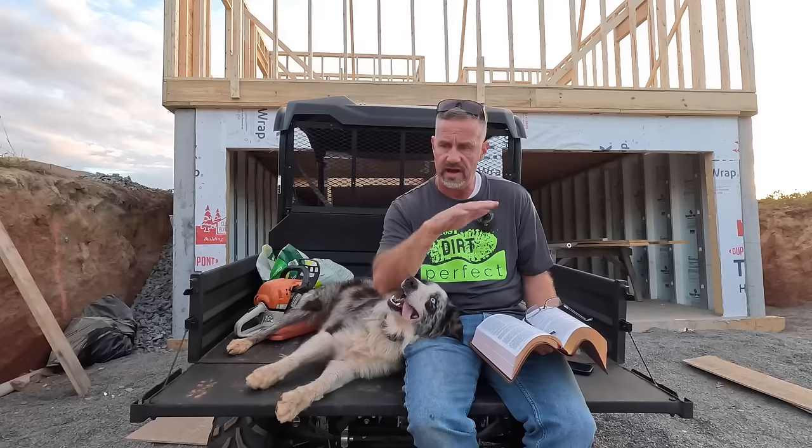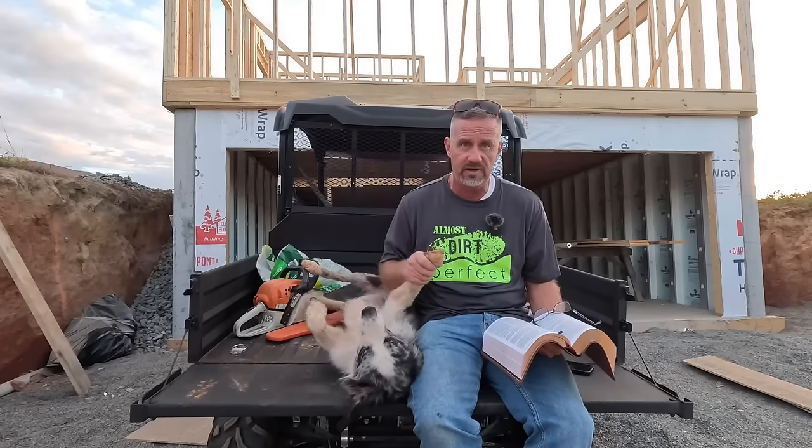All right, well, I appreciate you sticking around for the message, and what I want to talk about in this message is about having a strong foundation. I talked about it when I was making this video, how important it was to get that rock pad done exactly right. You know, 4 foot out from the wall, it had to be really compacted and put in there really well and packed with that packer, because these walls don't have a concrete foundation. These walls actually set on that pad, and that has to be right. It has to be compacted right. It has to be level so that this foundation has a good place to set.